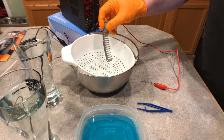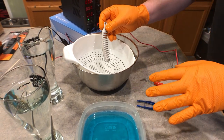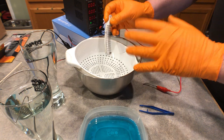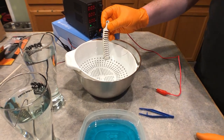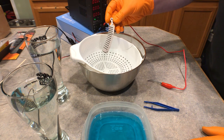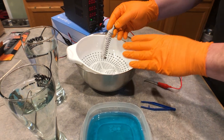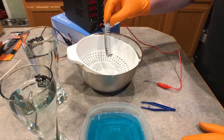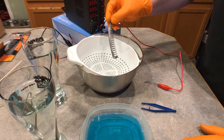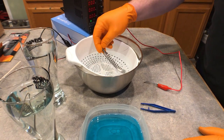Just to give you a heads up on what I've done so far: I've cleaned the part with some scotch bright. I did not etch the part at all using any type of etching solution. I essentially sanded it very aggressively with a light scotch bright. The reason I do that is because on this one I'm not trying to get a full polished look, but I do want it to have a little bit of shine. When you etch the part it makes it a little dull, so in this case I'm just using some 3M scotch bright.